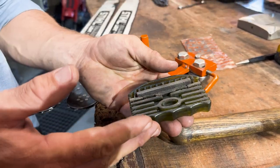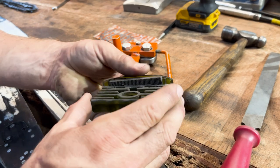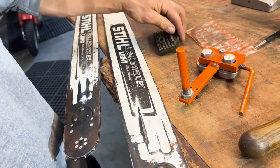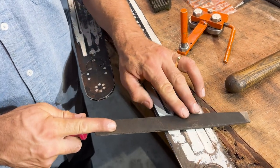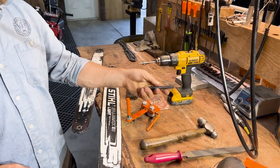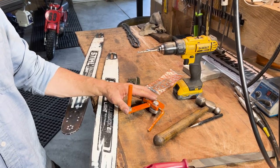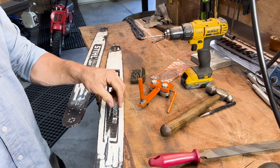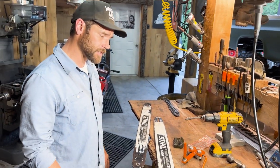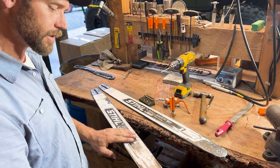The tools we'll be using: a flat file, and this little gem — it's for tuning the edges of snow skis. It gives you a 90-degree angle up to the file edge, so I'll use that to tune the flat edge. I'll use the large flat file to get rid of large burrs. To change the tip we've got a drill, drill bit, a punch, a new tip, ball peen hammer. To reset the gauge in the rails we'll use this rail squeezer — run it down and squeeze the rails back to the proper gauge. Those are the basics.